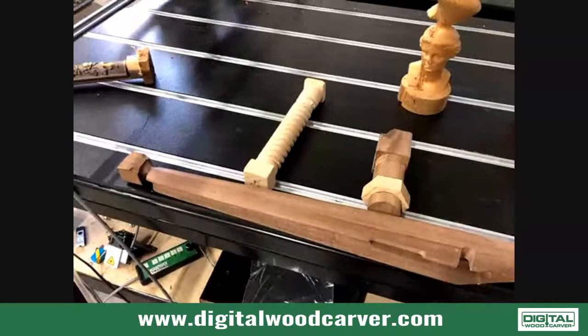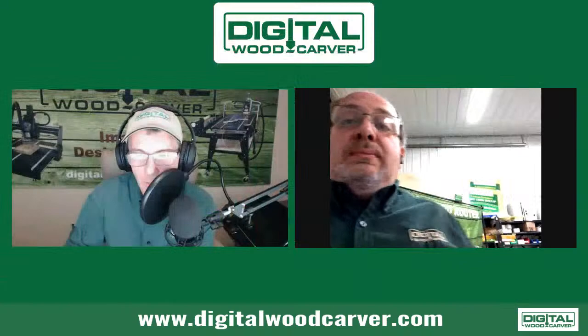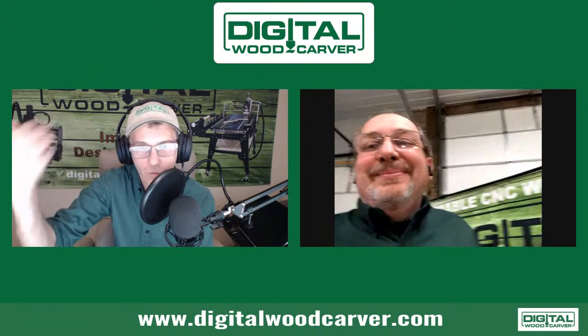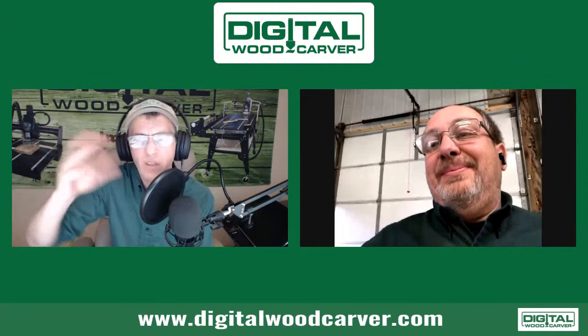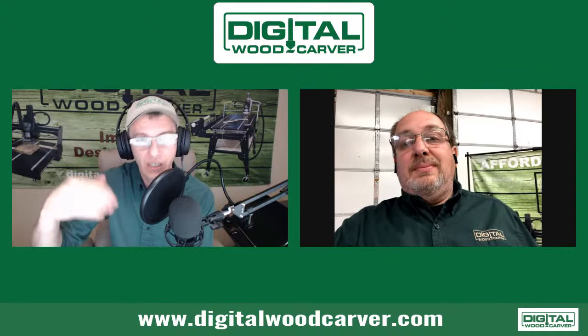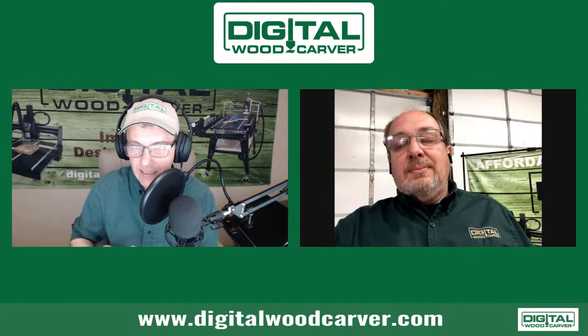For those of you thinking, oh man, I want to get the fourth axis just to be able to do gun stocks, let me tell you, and what Burl said, it's not for a new beginner. You want to crawl before you run. The fourth axis has a bit of a learning curve, not a bad one when you're doing wrap things like carving and engraving on spindles, but when you're wanting to get into statues or gun stocks or things like that, there is a learning curve, because it's not just the machine operation, it's also the design side of things, being able to get that design in there.